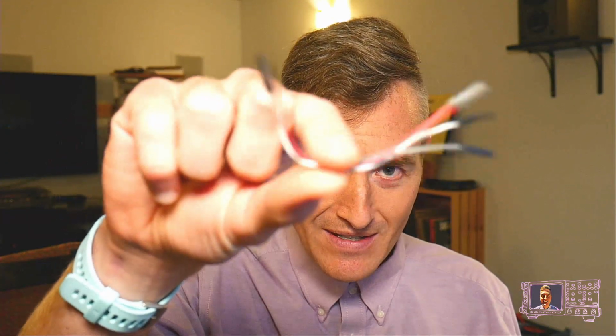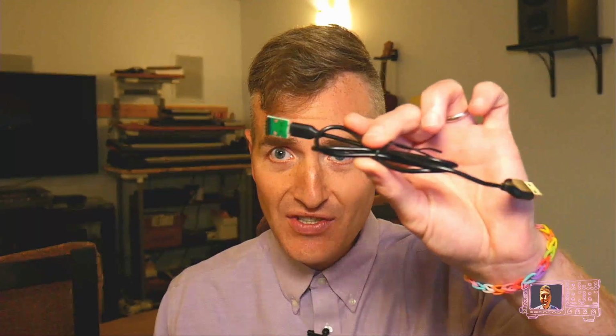But as I was saying, in the last episode, I used the time-honored debugging technique for engineers and people everywhere: bump the wires. And I used it on these three wires. I was having angry cicada noises in my amplifier. I was prepared to change power supplies, and I had alternative power connections that I was going to try. I had all of these preconceived notions on what was causing the noise. Ultimately, it boiled down to a loose ground connection, which, I mean, come on, seriously?